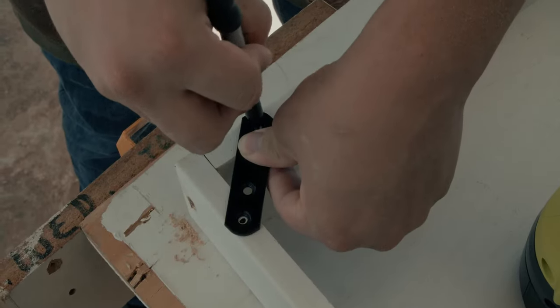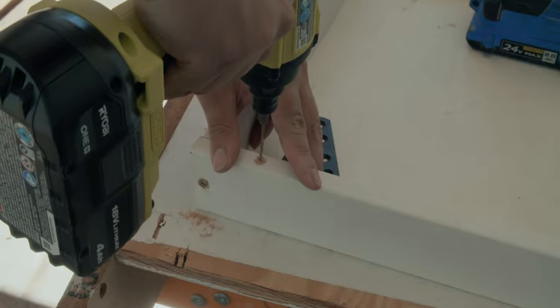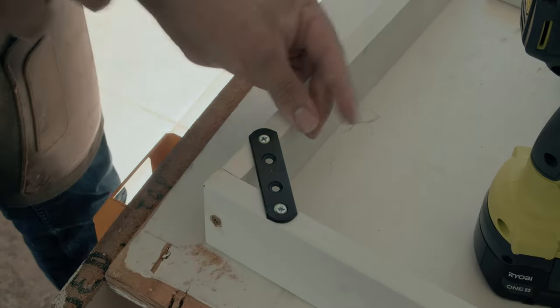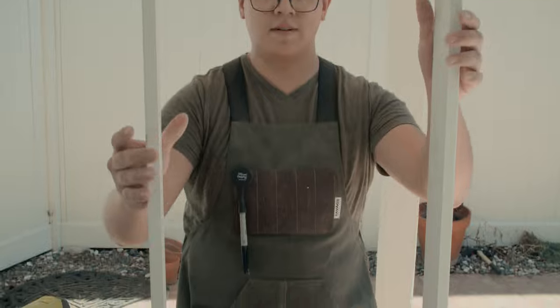We then lined up two planks and drilled pilot holes for a support screw, wood-glued each end together, and glued the screw in for maximum support. This was likely strong enough to hold the frame together, especially if you don't plan to move it, but just to be sure we added brackets to all but the smaller octagons and triangles. The corner pieces were then drilled to allow brackets to join them on every corner. Always drill pilot holes or else risk splitting the wood or MDF.